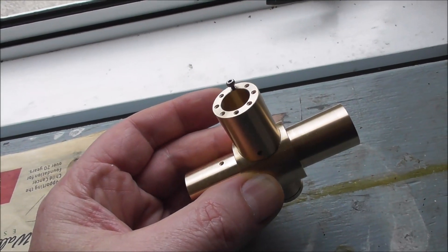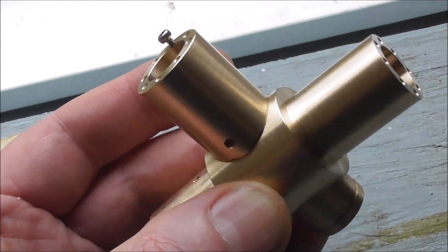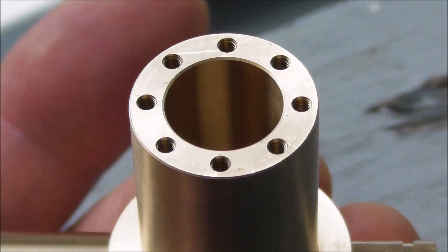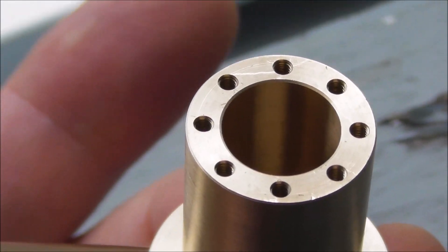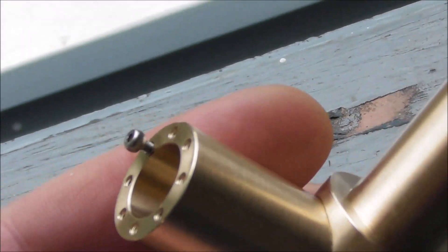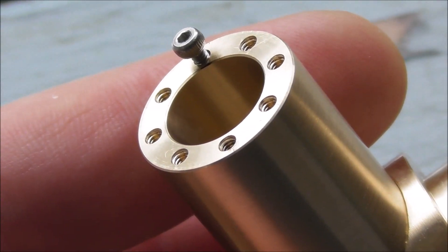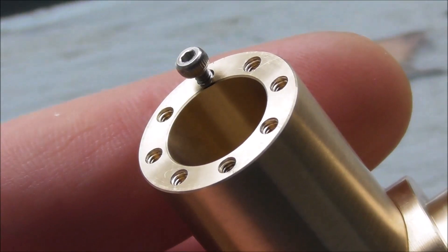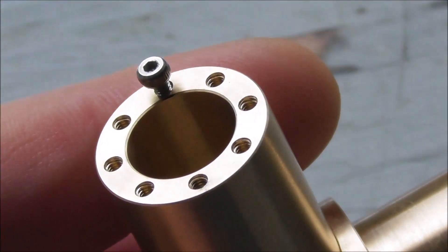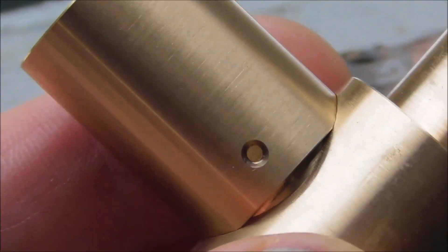Well, there's another tricky part I've just finished — in bronze this time. Two-millimeter metric threads, and that's always scary because those little taps snap very easily. Luckily it's not aluminium bronze — aluminium bronze would be a really scary proposal.